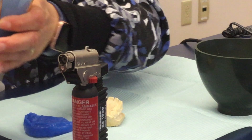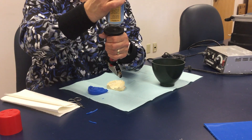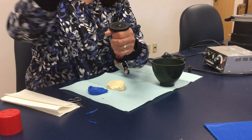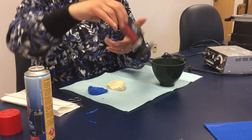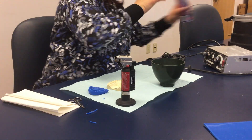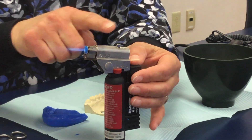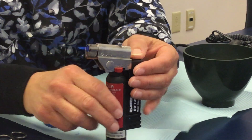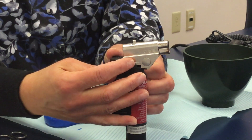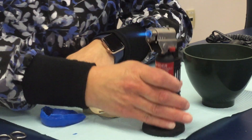I always want to check and make sure the flame is full, so I turn it upside down, grab the butane, find the little hole in the bottom, and push to insert. Once it starts bubbling, that means it's full and it's ready to go. Remove the butane from the area. To use the flame, push down on the back, keep your top lever in the center, your side black lever should be in the center, push it down, and lock it in with the red.